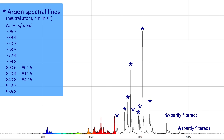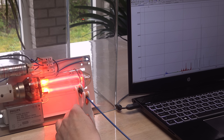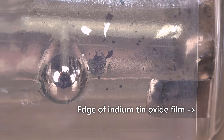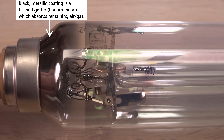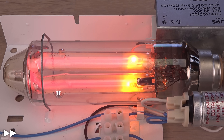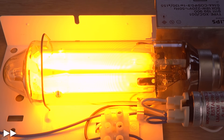The visible part of the early light is mostly red from neon and a little violet-blue from argon, mixing into a pinkish-red color to our eyes. The lamp is actually filtering both ultraviolet and longer-wave infrared out — UV-filtered to protect us from harmful radiation, and infrared-filtered with indium tin oxide on the inside of the outer glass tube to reflect the infrared heat radiation from the discharge back into the inner tube. The inside of the outer glass tube is even at a hard vacuum to make sure heat is not convected away from the inner tube. Even with all of this vacuum insulation and heat reflection film, it still takes close to 10 minutes before the discharge has warmed up the lamp to full power.